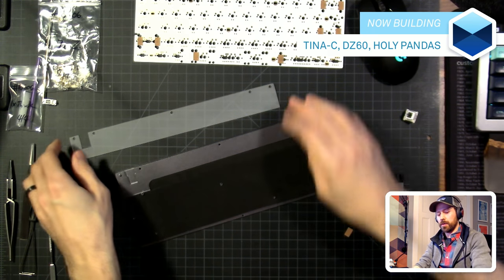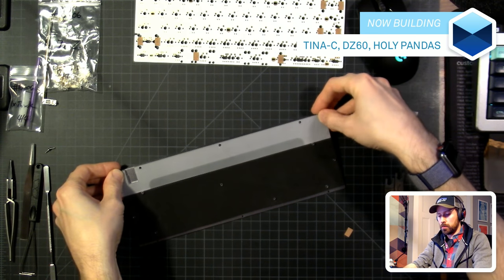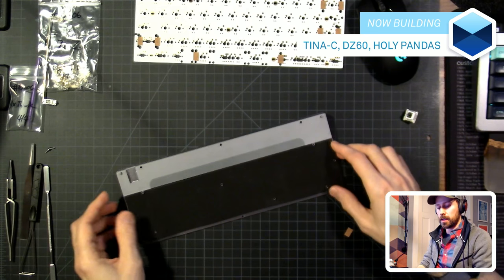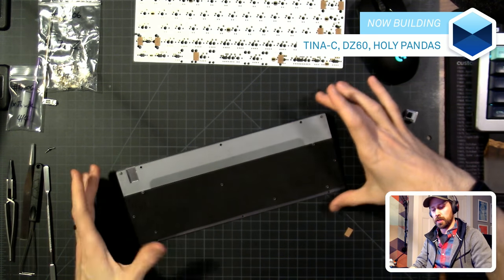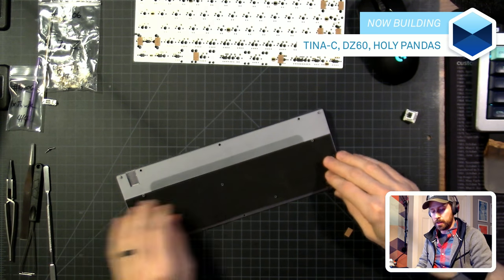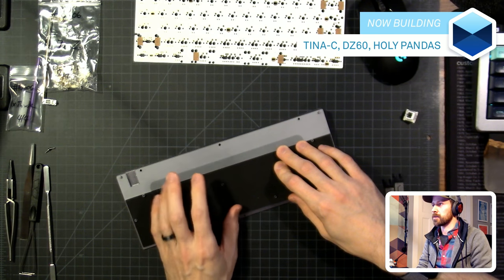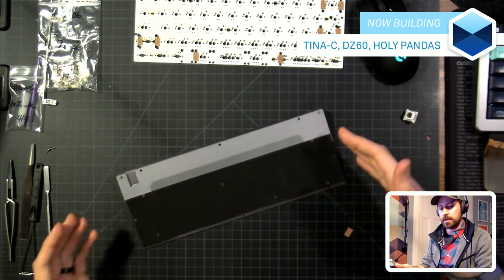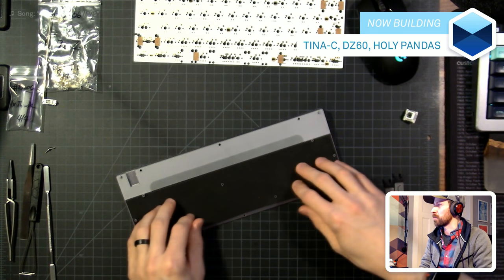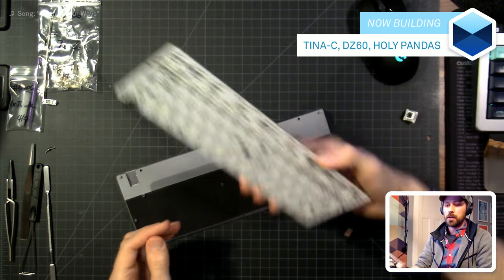I can't fill this back region because otherwise it kills the underglow on the board, which would be sort of silly. So I tested that, I plugged that in, I put the PCB against it, put the top plate on to make sure it still glowed without issue, and it was good. I know craft foam against an LED is not going to be a fire hazard, but still, what if it is, so I let it sit for like 3 hours on, and then pulled it off and touched the craft foam to make sure I didn't melt it. And it didn't, because those LEDs don't get warm at all.